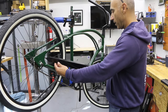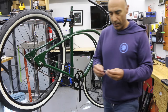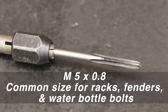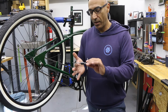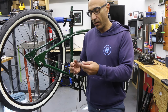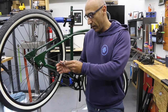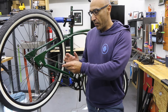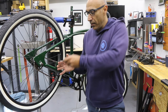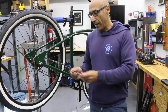The chain guard screws go in here — one screw here, one right over here — and this one got overspray as well. We're going to come in straight, screws going this direction. The most important thing is to come in completely straight. Handle this with the gentlest fingers possible. So we're just coming in straight — I may put my finger here gently. The biggest problem is you think you're in straight but you're actually angled up, down, or side to side. So it helps to get another pair of eyes, someone watching you, trying to line that up.